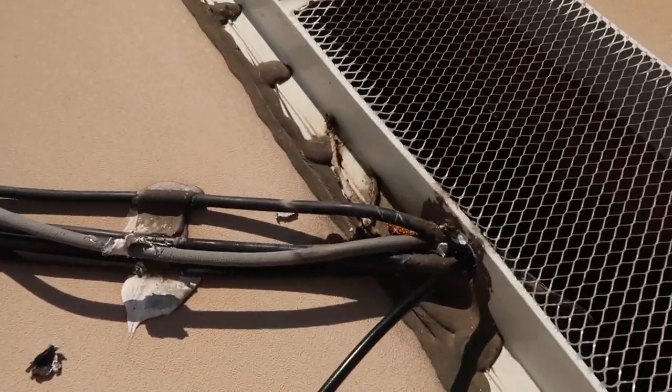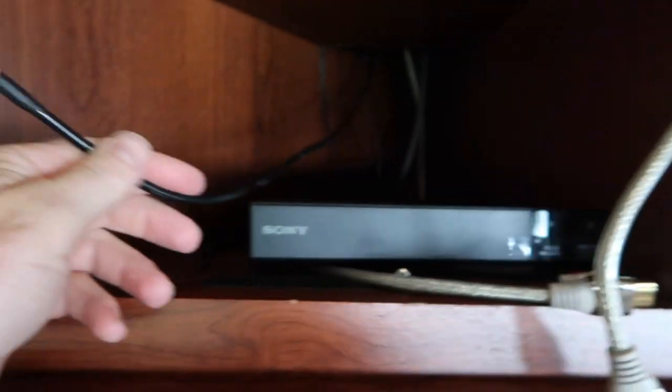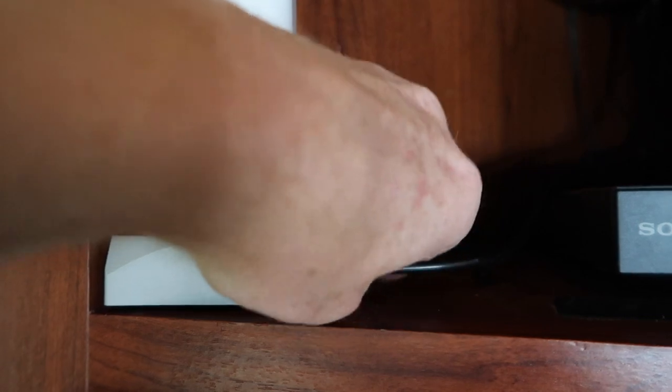I got the cover off and now I'm just going to run the cable line down along with these other cable lines, in through this hole and down with all the TV stuff. After fishing the cable in from outside to get to the internal antenna, I had to remove the TV and just follow the same lines that come in from my TV antenna and satellite dish outside. Now that I've got all the wires ran, I'm going to do a dry run just to make sure everything's working before I go gluing or drilling anything. Everything says I shouldn't have to drill any holes in my roof, so that's going to be a real bonus — I would rather not have to screw into my roof.